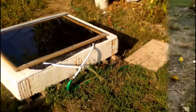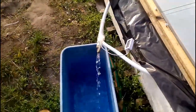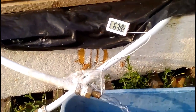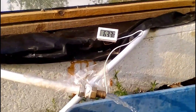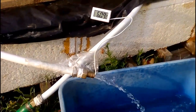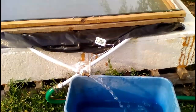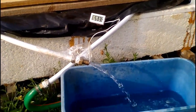Now I open the hot water tap, and we see the water which comes here, and before that it leaves the white pipe through this outlet. Let's take a look at the temperature of the water from the pipe outlet, when the sensors showed these temperatures of water inside that black sleeve. This sensor shows the temperature in degrees Celsius of the water which leaves the white pipe. At first the temperature is almost 64 degrees, because it is the water which has been inside the pipe for a long time. However, the temperature decreases, because now we see water which has also long been inside the pipe but near the bottom of that black sleeve, where the temperature is less. We must pay attention that the water temperature began to decrease rapidly, and that now more than 4 liters of water have left my solar heater. I use almost 40 meters of that white pipe with an inner diameter of 12 mm, and we can calculate that the internal volume of the pipe is 4 liters.